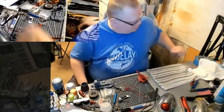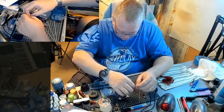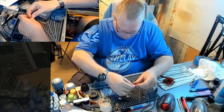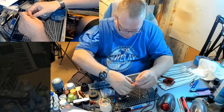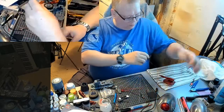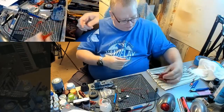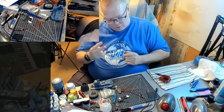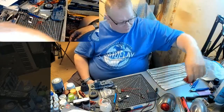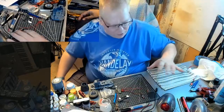Okay. Turn my light back on here. Now I will unplug these. Just undo this. I don't need these wires nearly as long as they are. I'm just keeping it like this until I'm ready. The end result of this wire is it's going to be maybe this long, and that's it. Because I have to wire this one in conjunction with two other LEDs, and I'm going to wire them in series. So yeah, there's that. So that's this guy. That was my first real custom one.